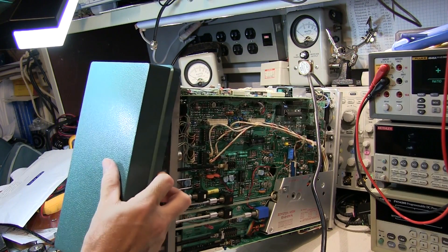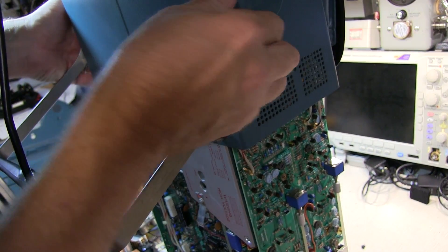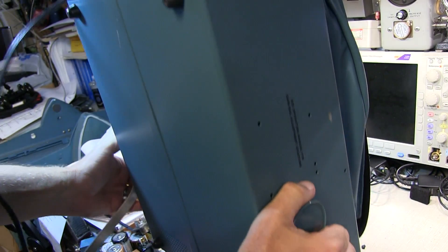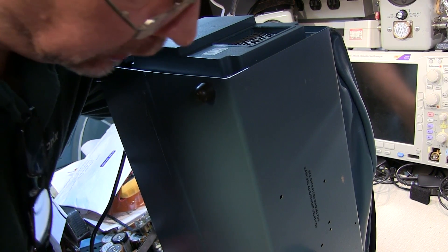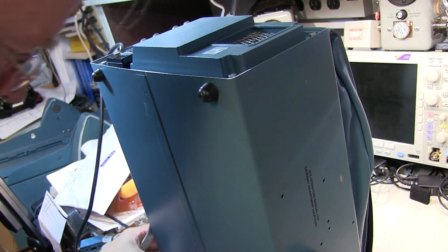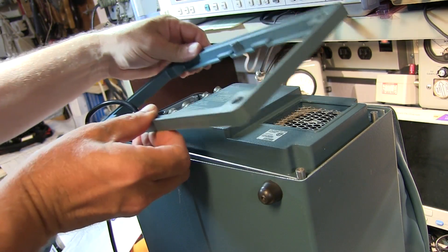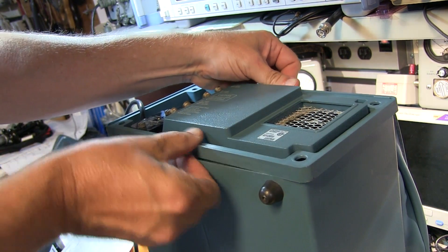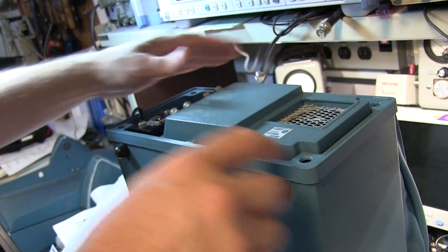I'm going to put on the front face so I can stand it up to slide the metal half case back on. There are a couple of little leaf springs — you want to be sure they don't get hung up. The case slides on nicely and then you fish the two halves of the case down into the metal RF gasketing at the front panel. Slip the plastic bezel back on, making sure the top is on top and the bottom on the bottom, keeping the RF gasket material in place. Push that in place and put on the six screws and the feet.